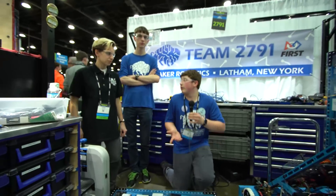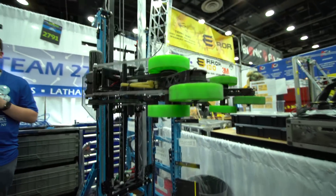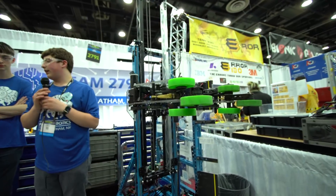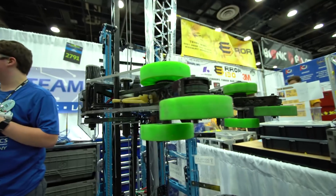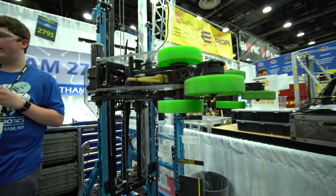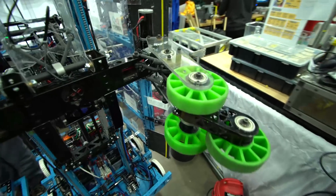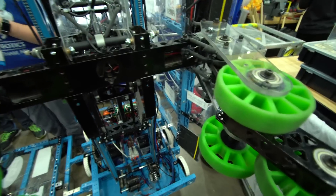The other really cool thing about our robot would be the intake. We redesigned that for champs. We've got these outward-facing wheels that are actually floppy — you can kind of see. Those were inspired by Team 33's intake that they brought to their original regional, which is now redesigned — kind of funny. But this works really awesome because it allows us to guide a cube into the intake. That's what allows us to get into our two-cube auto, because we can pick up that cube whether we're offset left or right since we can guide it in.